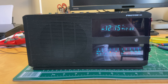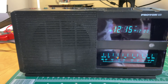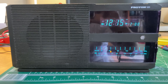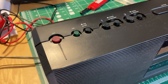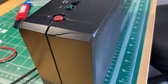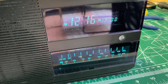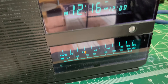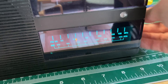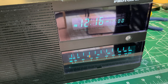Here's another look at the Proton radio. I didn't video any of it, but I went through and replaced the lamp in the dial light with an LED, and that worked quite well. I've also done a very straightforward wipe-down of it, which cleans up the case a lot and makes it look pleasant. I did find another crack that's probably glueable. I have ordered a capacitor for the power supply — the dial looks very nice, and the radio, apart from a little bit of hum, sounds very good. My guess is that capacitor will solve the problem.